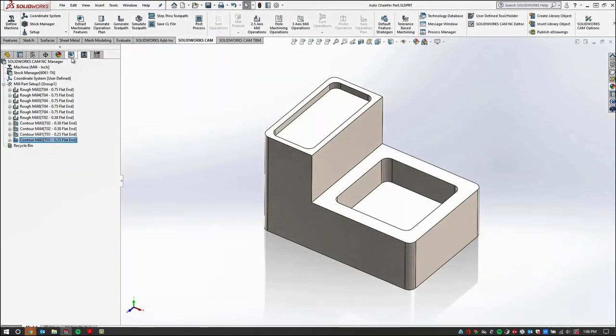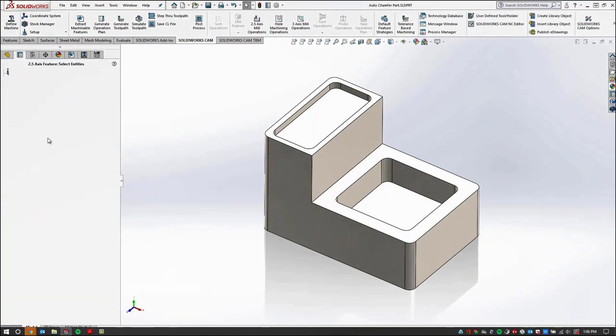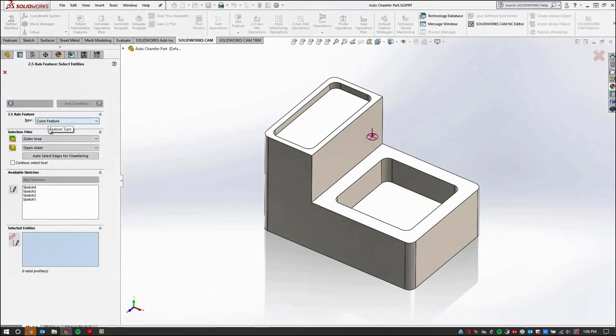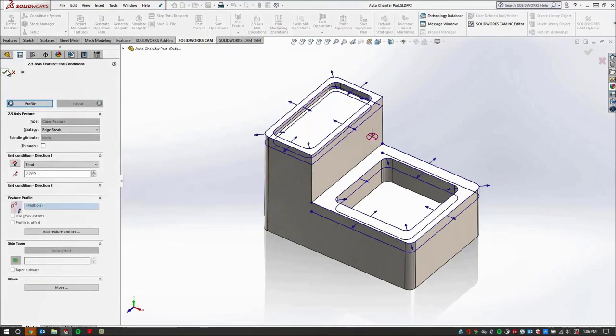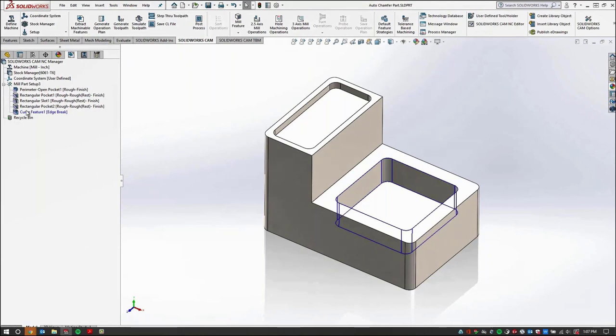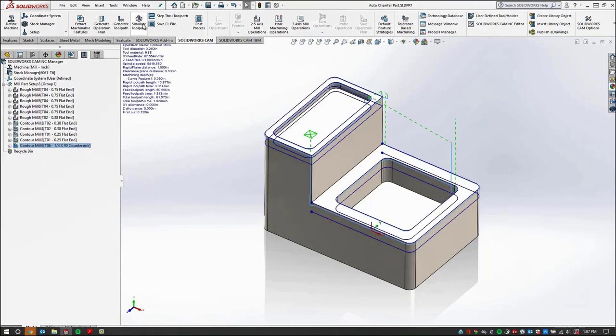Here's another one. It's super easy. Again, this and that are both in Standard. Everyone gets this. I can basically look at it from the standpoint of my 2.5 axis cutting direction and say, hey, all the edges, just go ahead and break those with a chamfer. Just do it. I don't have to select anything. Just look at it, tell it what size I want, and it'll just do it. It's super easy. And it's intelligent, of course, so as it runs and processes the toolpath, it'll step out,